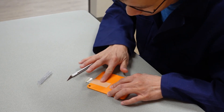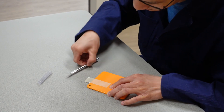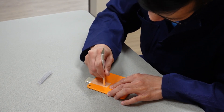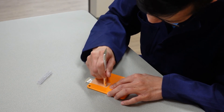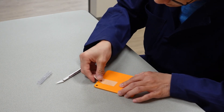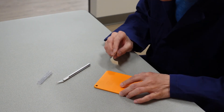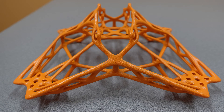Pressure sensitive tape is then applied over the scribed area and pulled off sharply. Adhesion is classified by the percentage of coating removed by the tape from the substrate. 5B is the optimum classification at 0% coating loss. 4B is often acceptable at less than or equal to 5% loss, and anything else is generally considered a failure and not acceptable. Here we have achieved a 5B adhesion.